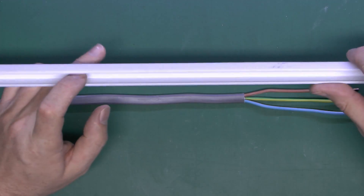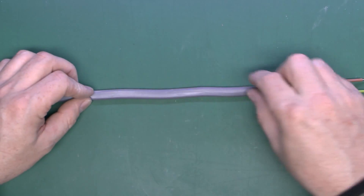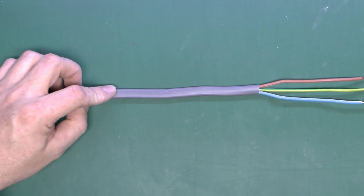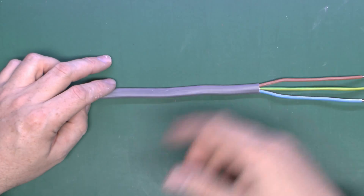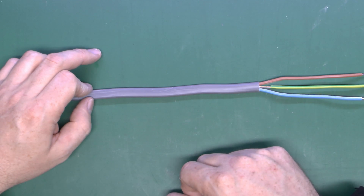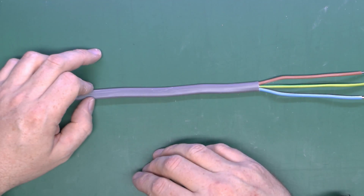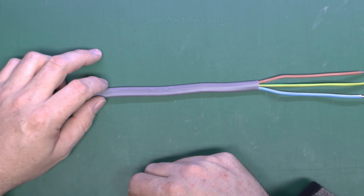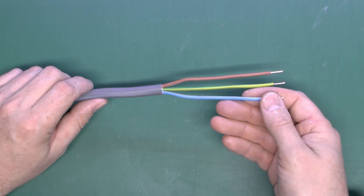You can also get what's called capping — essentially the same plastic material but placed over the cable on the wall, secured with a couple of nails either side. That's purely to hold the cable in place and doesn't offer any real protection, since it's only thin white plastic — a drill will go straight through it. You can also get steel capping, which is galvanised, placed over the cable and fixed with nails. Again it's just to hold the cable in position, not to protect it, since it's thin enough that a nail or drill will go right through and into the cable.